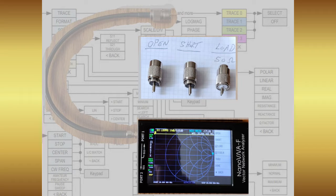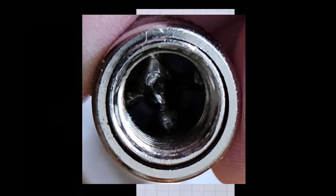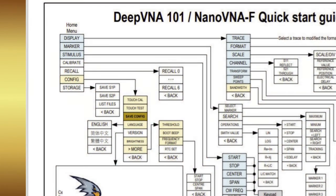For that I needed three PL-259 plugs: one open circuit, a second short circuit, and the third with a non-inductive resistive element as shown. With those in hand, I referred to the handy features menu map provided by the creators of my Nano VNA. The map shows the necessary navigation steps, and while yours may differ, the process should be similar.